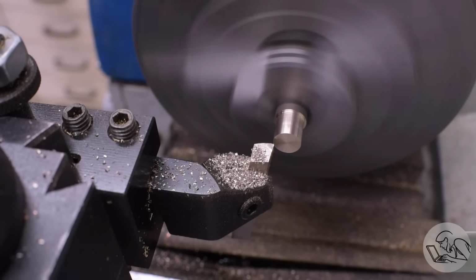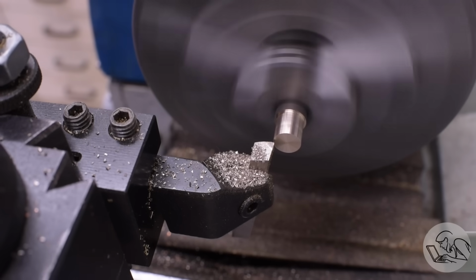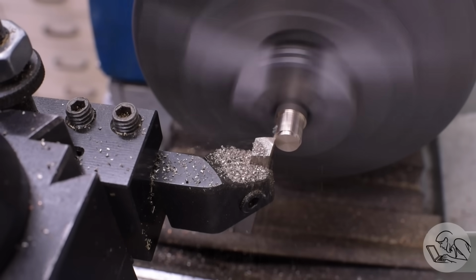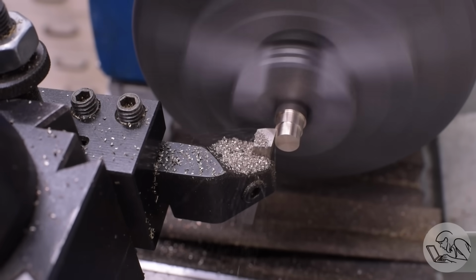Solder is strong in shear but not in tension, so you can't solder things securely to the surface of a thin wall like this. You have to have a vertical surface for that solder to hold on to. Boiler bushings give you that.